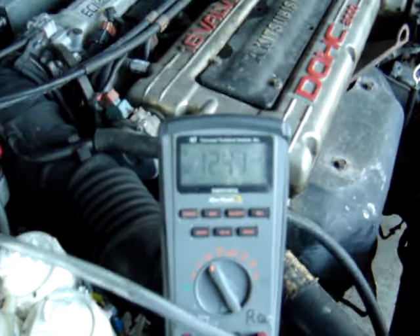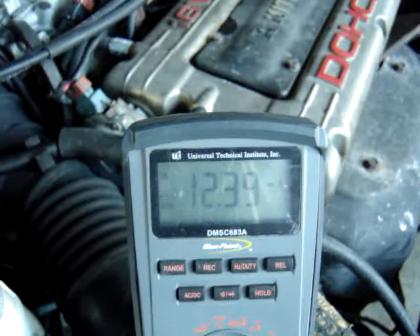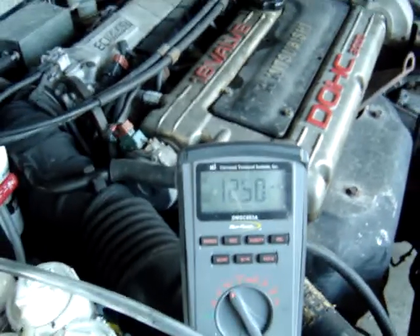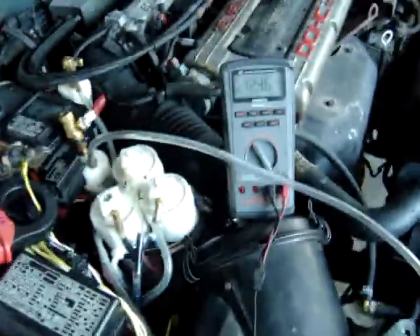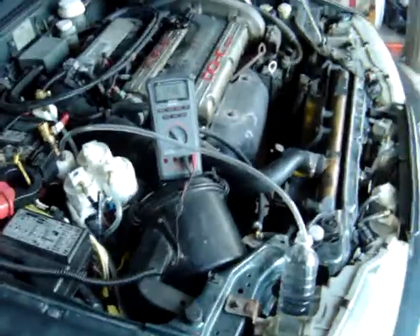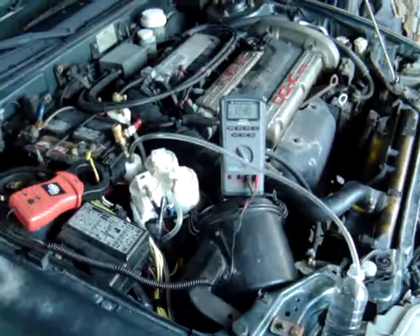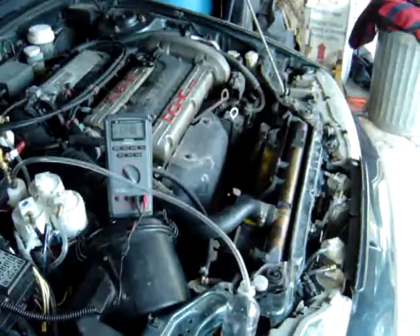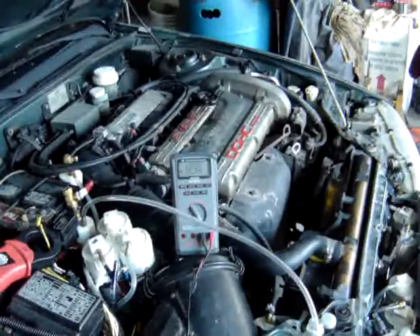As you can see, the complete amperage use on this 7-cell setup is only 12.4 amps — and that's after at least a half an hour of production. Each individual cell has an eighth of a teaspoon of baking soda in it, so it's very minimal baking soda. I could increase that considerably and still have my amperage well within check.